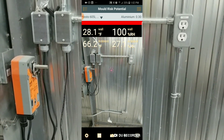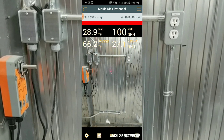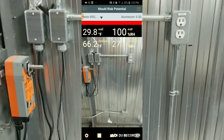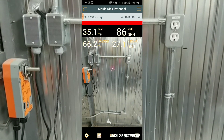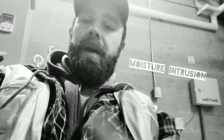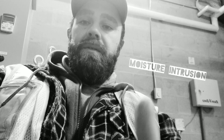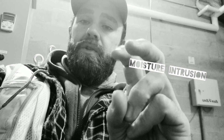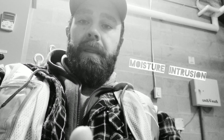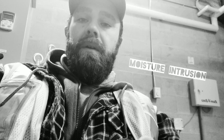We really do have to look into that and rectify it. I recommend you don't use the word 'mold' in front of the customer — just let them know there's a potential risk of moisture and they might want to look into it. That is how you use the mold risk potential menu with the 605i and 805i smart probes. The last thing we want to do is tell a customer they have mold and start a panic. What we just did is not checking for mold — it's checking for the presence of moisture behind a wall that could potentially turn into mold, maybe.